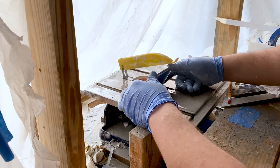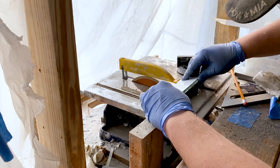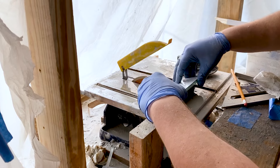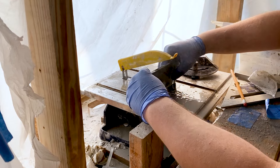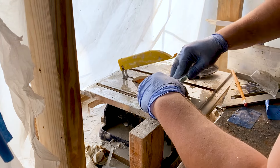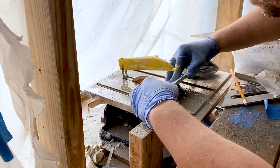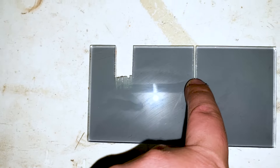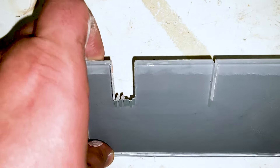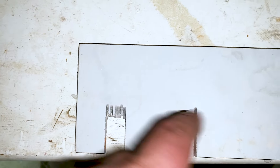To cut the tile, start by cutting each side of the piece you need to cut out, and then move from one side to the other by slowly cutting away saw-sized strips of glass. I started the cut at a 45-degree angle, and then lifted the tile upright until it gets to my pencil mark on the back of the tile. If you try to make these cuts with the tile laying flat on the saw, you will have uneven cuts in the front or the back of the tile. The cut lines need to stop here, but at the back of the tile, the saw stops here. This process takes time and patience, so don't try to rush through it.